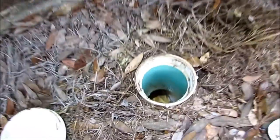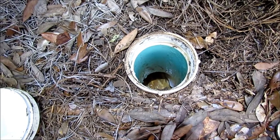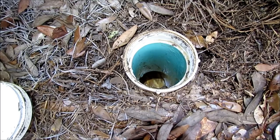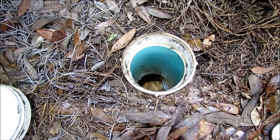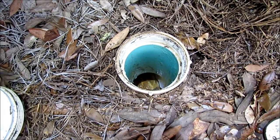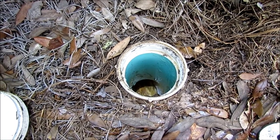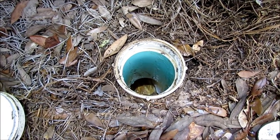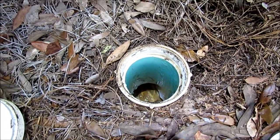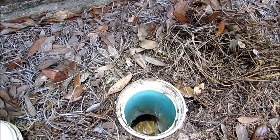Let's take a look inside. There's no water standing in it, so that means there's no clog. Now if you had standing water in here, chances are your clog is on this side of your plumbing, and it's probably going to be between this clean out and the street sewer or the septic tank if you have one. That's another good way to find out where your clog is by coming out here and opening up the service cap. So if you don't see any water standing in this and you've still got a clog inside the house, that means the clog is going to be on the house side instead of on the street side or septic tank side.